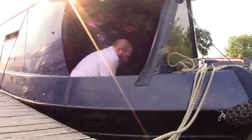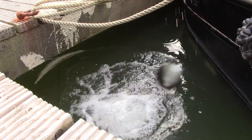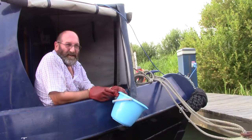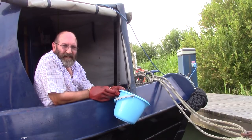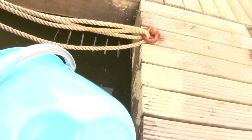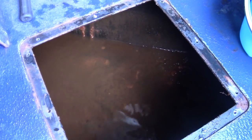The next task is to get rid of the water in the tank. You might be able to hear a tap running in the background, but that is very slow so the only way is to bucket the water out. It's amazing how much water the tank holds — I know it's 150 gallons, but when you see the sheer volume looking down into the tank you appreciate it. I've calculated that 150 gallons weighs about two-thirds of a tonne, so when the tank is full it keeps the boat weighted down at the front. I've got quite a lot of the water out with about two or three inches left; I've disturbed the sediment, which is why the water is looking browner than before.